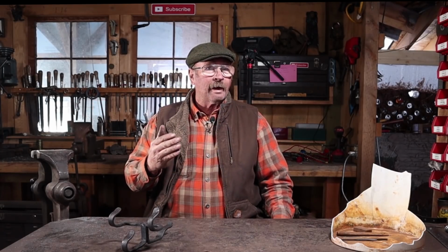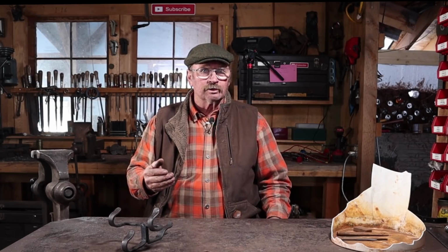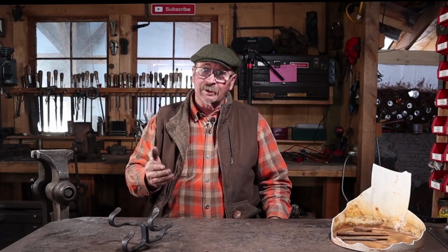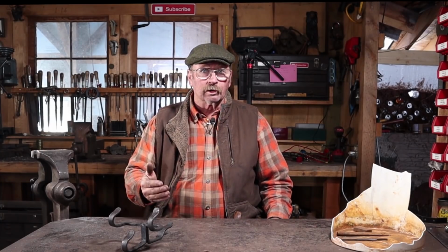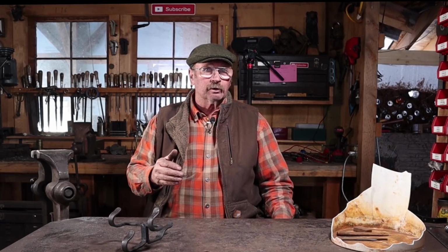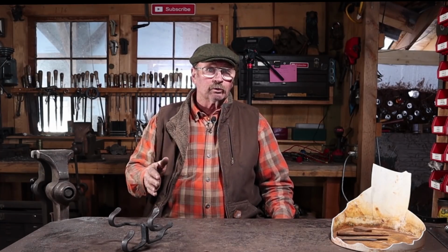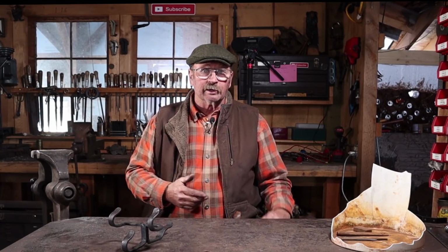I will say that if the power goes out regularly where you live, having an atmospheric gas forge or a solid fuel forge with a hand crank blower so you're not dependent on electrical current to work comes in kind of handy. That's one reason I'm a little nervous about the ribbon burner forge project, because it will require electricity. But if I keep the chili forge around, I could always bring it in during a power failure. But the power is still out.